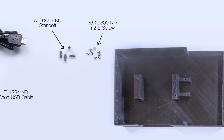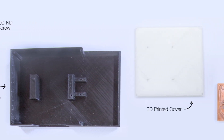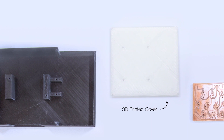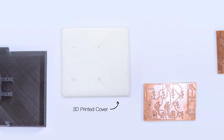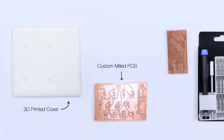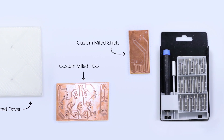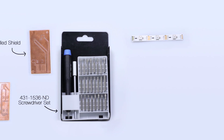I also created an enclosure I 3D printed, and a lid for the enclosure that will also allow me to mount my Raspberry Pi to it. The STL files will be available in the MakerIO blog or on Digikey's Thingiverse account. I also used a Bantam Mill to design a board for the button matrix and a shield to make it easier to connect to the Arduino Leonardo. You'll need a screwdriver. Optionally, I added 3 NeoPixels for lighting effects.